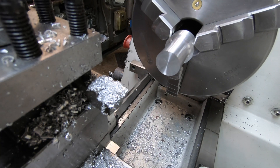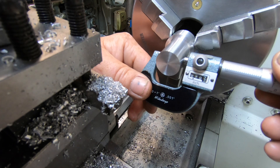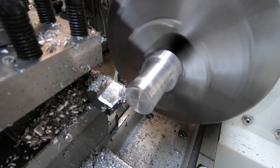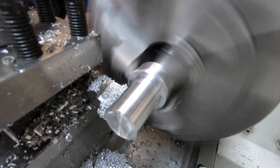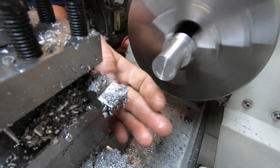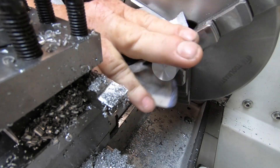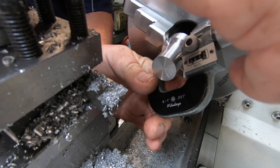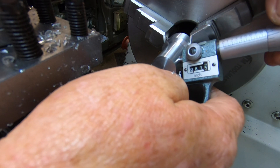Reading 0.904 — that wasn't a bad cut. 0.904, and we were working for 0.875. 0.904 — what's your verdict? That's not bad. 0.875 — 0.904 — that's it, OD's done.